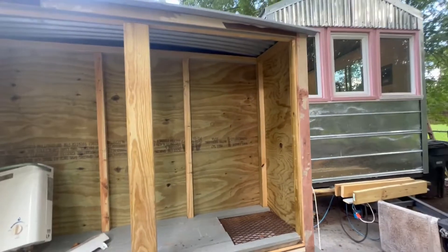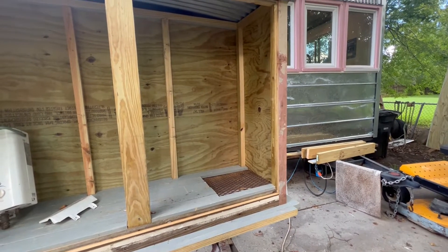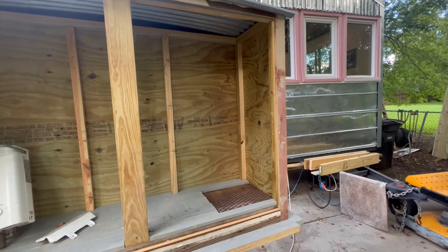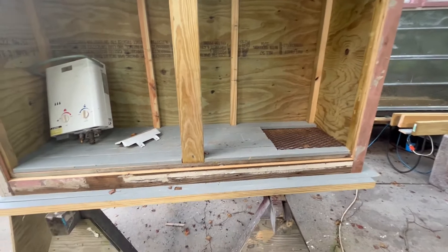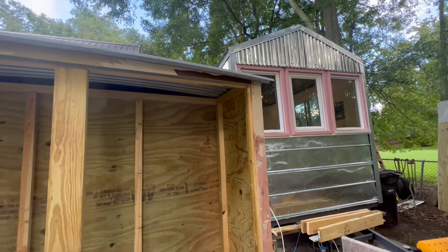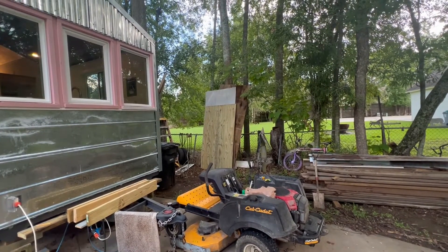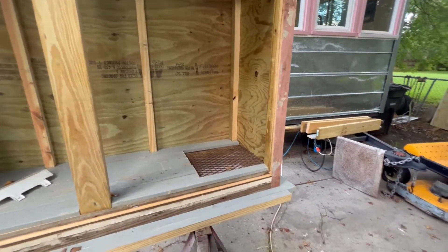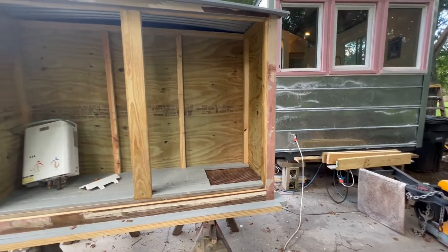Time to make the doors for this little work cabinet. I've been thinking about this for a while - I really wanted to make a wooden frame and inset it with lap siding, because the lap siding is almost 100 percent weather resistant and it wouldn't be that heavy. But I just couldn't figure out how to make corner joints strong enough to not sag, because wooden joints out in the weather don't stay together too well. So I'm going to pull down a sheet of white three-eighths fir plywood and make the door skin with that, and on the back side I'll put some two-by-twos for strength. It won't be as cool but it'll be more practical.